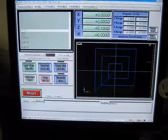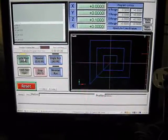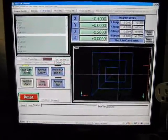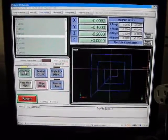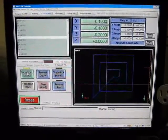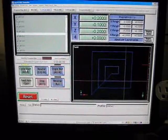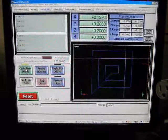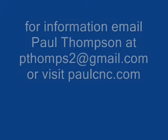Here I'm going to run the same spiral type program — it's really a rectangular spiral. I just started it; the spindle's not on. Now, when you hear a little bit of movement before the thing actually moves, that's the backlash. That's enough — I just started it because of the danger.